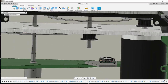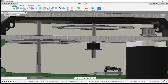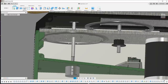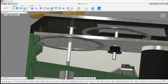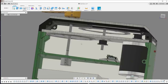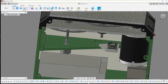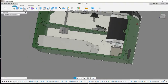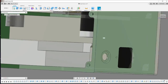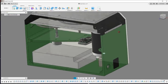And there are some bearings that are going to be mounted in these plates. So just one bearing for this guy. It's going to be pulled symmetrically. So once up here and once down below. So that'll be relatively even. And then up here, we've got two bearings just to keep that relatively secure. And this is coaxial with the potentiometer. And we'll just have those wires running out to here to the feather board and keep the power supply electronics down at the bottom. Now I've also got a hole at the back so we can run some wires.